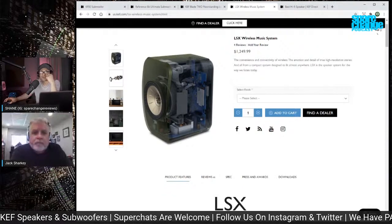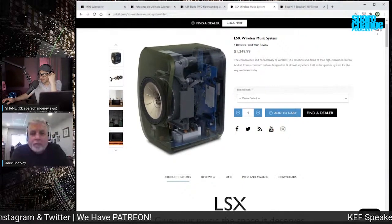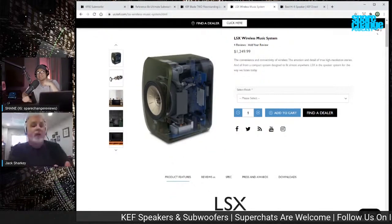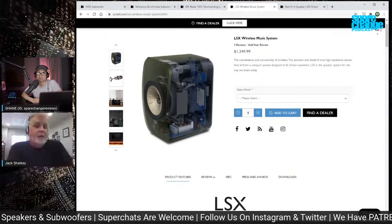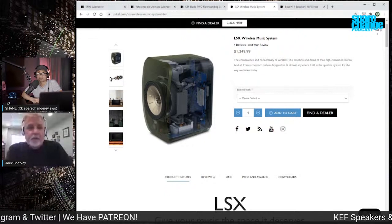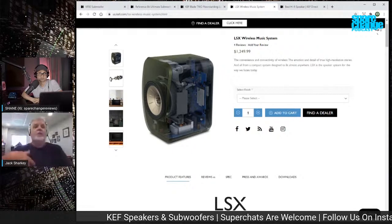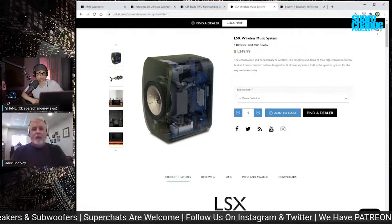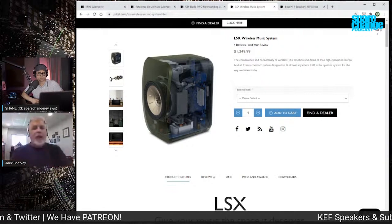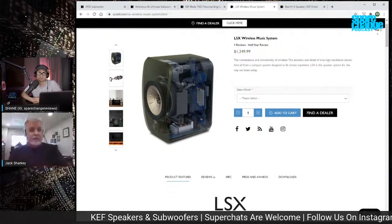The soundstage is just amazing. I concur — I have them on my desk right now, I use them as my monitors. As for the tangerine waveguide — why call it tangerine? Well, because it kind of looks like a tangerine. The tangerine waveguide is basically like a compression driver. It sits over the tweeter and acts as a further waveguide for the high-frequency driver, and it also allows us to get a couple of dB more energy out of the tweeter than we would without it.